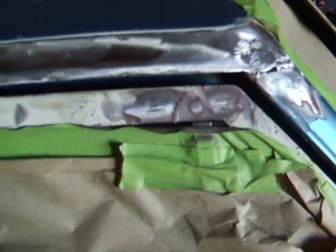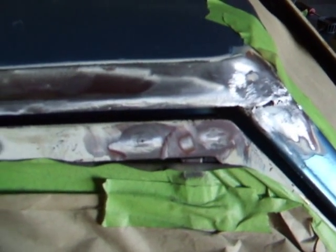All the trim, everything was good to go — it was welded, and I let it air dry. You don't want to quench it with a rag, otherwise you can screw up your body panel. Everything's welded, ground, ready for mud. From the time I started until now, I may have half an hour in each side, so it's pretty quick.